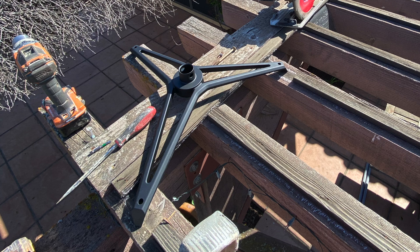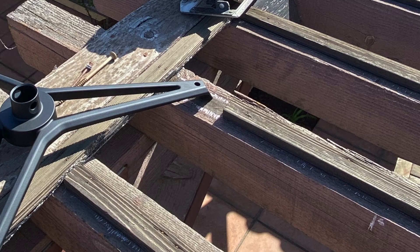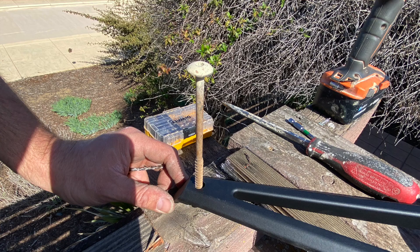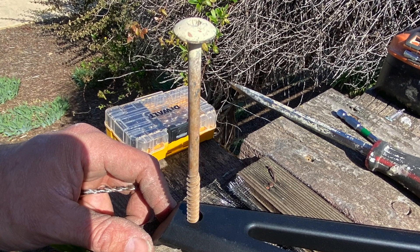The next thing I did was attach the satellite dish base to the pergola. I actually got lucky — the legs lined up perfectly with the wood. Originally I was going to use some three-inch stainless steel deck screws with washers, but the satellite dish base sticks up about an inch, so there would only be about two inches going into the wood. I was worried about the screws pulling out during a really high windstorm, so I ended up using six-inch by quarter-inch lag screws to hold the satellite dish down. That way I don't have to worry about it blowing over.